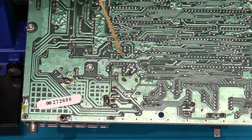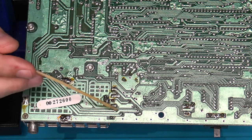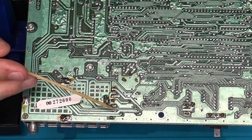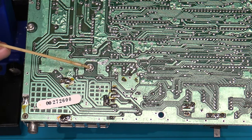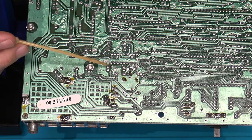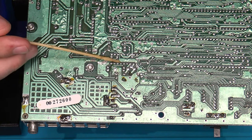And these are, in fact, 18-pin IC chips. So in looking at this from the bottom side, this is where the RF modulator is, so use that as your guide to know where the chip is, because here's where the RF modulator sits. And over here is one of the bracket screws that holds down the power supply regulator board inside. It's basically just to the right of that in your particular perspective.